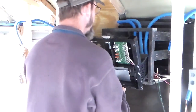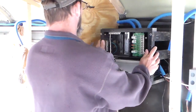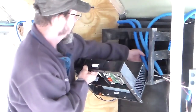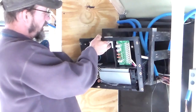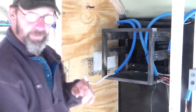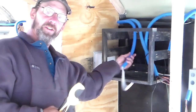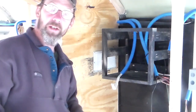Our unit is going to slide in there just like that. Eventually we'll secure it with screws. But now I've got to trim the conduit so it's just the right length to go into those knockouts. I think that's going to be a bit of a pain, but you've got to leave them long so you make sure you get enough. I've got my PEX tubing cutter — maybe that's going to help. They make a fancy cutter for these but I didn't feel like buying a whole separate one. So let's see how it goes.